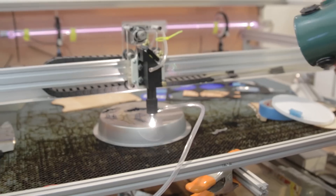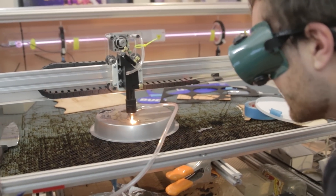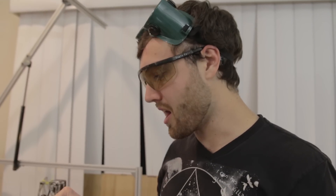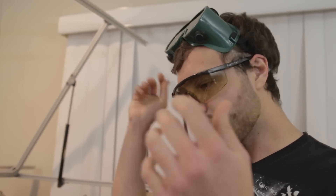We stopped filming halfway through and are picking it up like three days later — I'm wearing the same shirt, but it was washed this time and still smells bad. Let's cut more batarangs. It pierced and then it stopped. Oh, there it goes again. Let's just wreck stuff. Oh dear Lord — you see what happens: the instant the oxygen starts going it just blows the hole out. It's like the Taco Bell experience, and then it will stop any time it gets too cold. We need a bigger laser — this is not possible. You have to have something that can dump a ton of energy in. In conclusion, myth busted: cutting cold you can punch holes but it takes forever; cutting hot you can punch holes but it takes forever; using oxygen you can punch really huge holes but your parts are worthless. So there's no middle ground — maybe with a higher power laser tube.